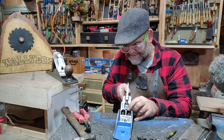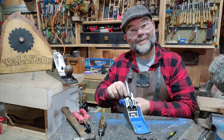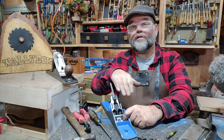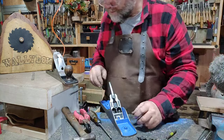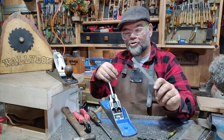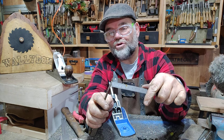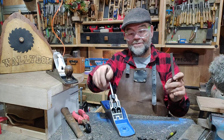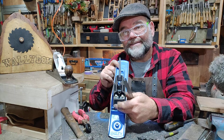That's better. So that's loose at the minute — I'll just tighten it just a touch so it's not wobbling about but not tight. Then we've got to adjust the frog forward and back to make sure it lines up with the mouth of the plane across here. Let me grab my rule. Now, I know some people say 'why don't you call it a ruler?' — well, a rule starts from the end, whereas a ruler starts a few millimeters in like a school ruler. Just so you know.